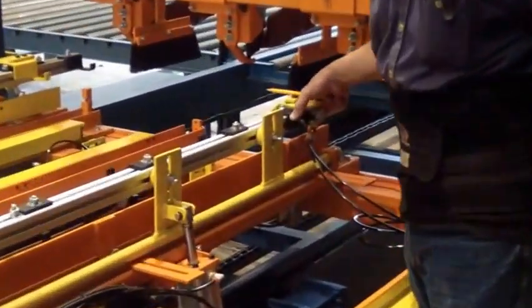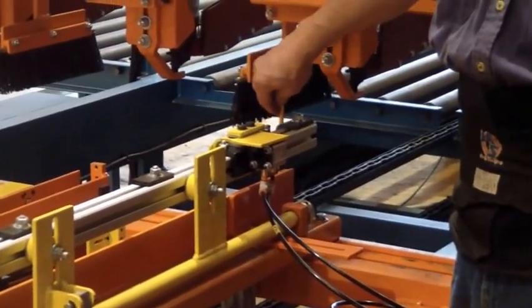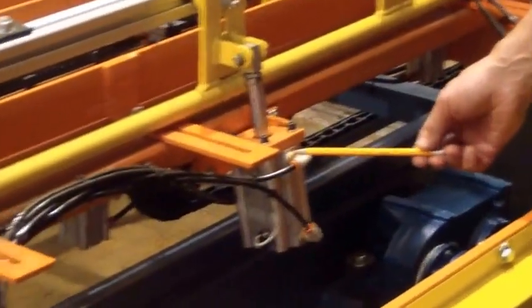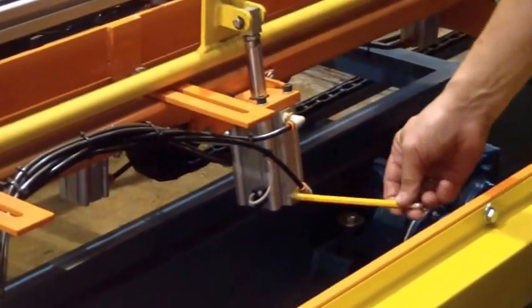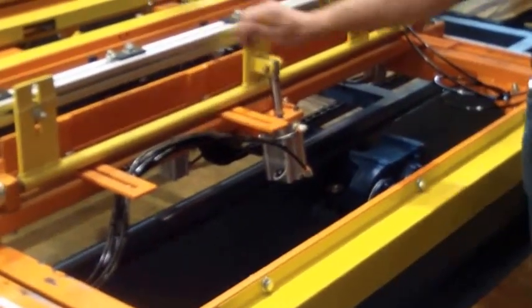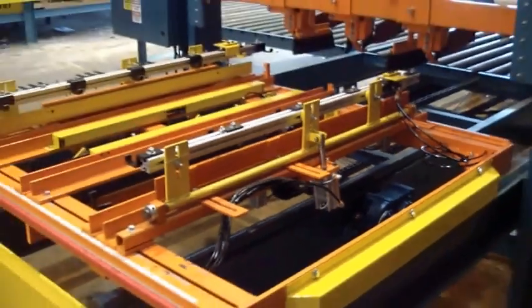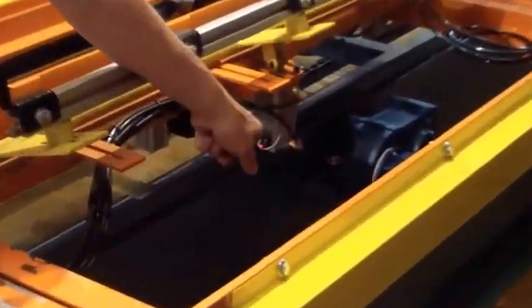This activates with forward motion of the machine to press the deck boards forward to this stop here. This is your top board cylinder. This is a magnetic limit switch, number 4 and number 5. If those are not lit, the stacker will not stack. That indicates the arms are open, telling the computer it's okay to stack. There, the MLS switch is on, so the computer knows it's okay to stack.